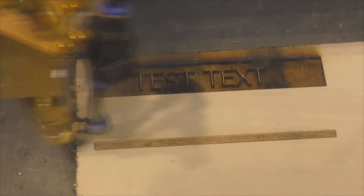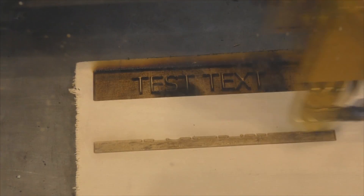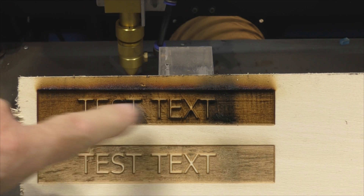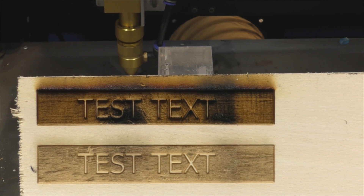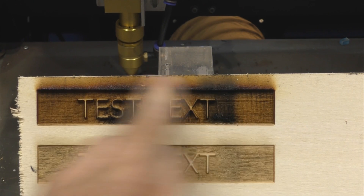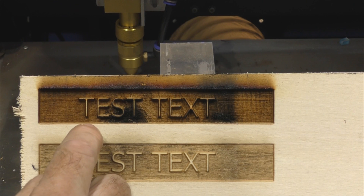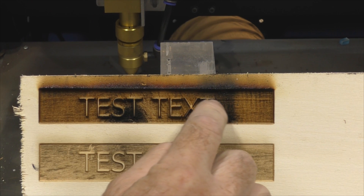I've got my machine back — it was as simple as that, just one change, and nice tension on the belt. The head mounting plate goes back on, set height wise about 24 millimeters down, check the squareness of the beam, and I'm pretty happy. Let's do some tests. You can see what 200 millimeters per second looks like — the head coming down from the top left corner, so all the smoke was being dragged across the text. Then doing the same thing starting from the bottom left corner running at 400 millimeters per second.